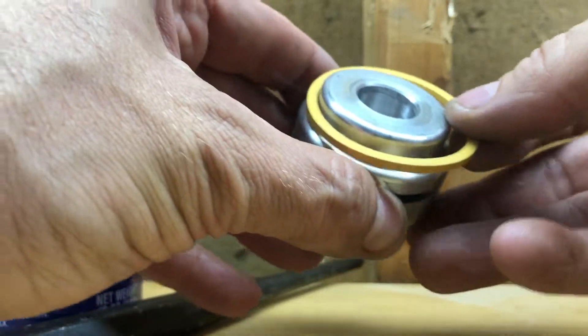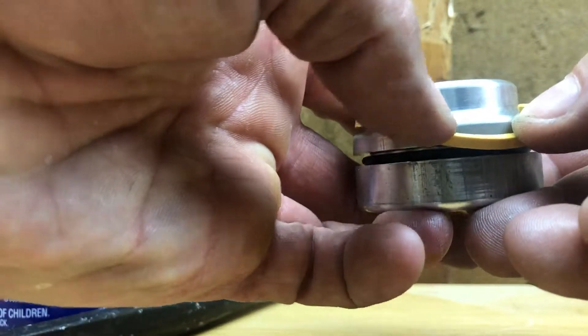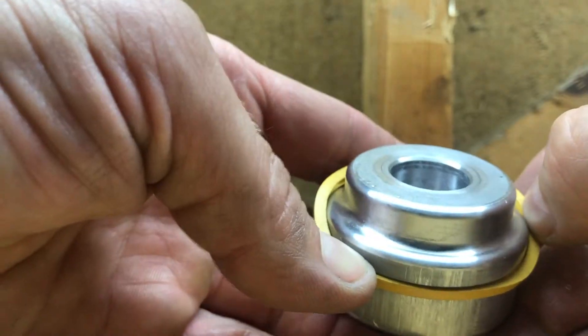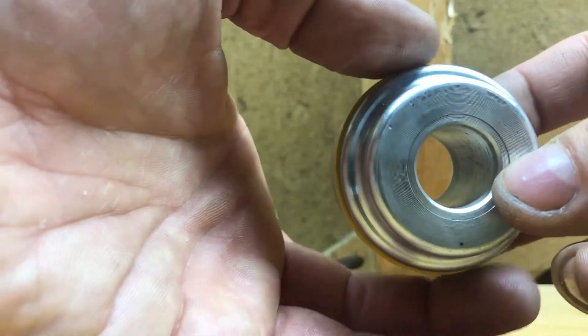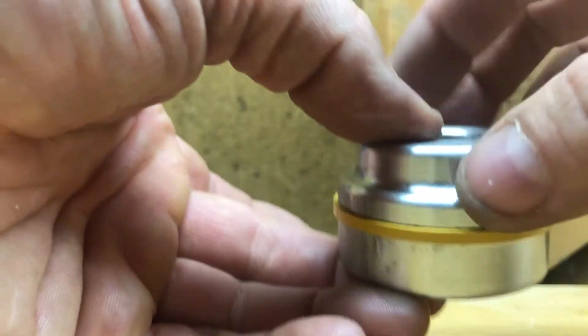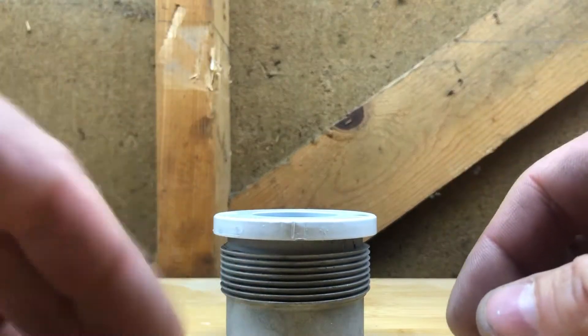To get the Teflon ring on, slip it over the top of the piston so you have a little give, then slide it down into the groove. Use one thumb to hold it down and another to slide it around slowly — don't roll it, just push it all the way around until it fits, with the o-ring behind it. It's going to be a little large because you stretched it, but just let it sit and it'll squeeze in enough to get inside the cylinder. The small o-ring goes right inside the end of the shaft.